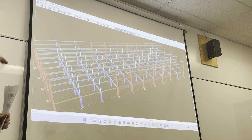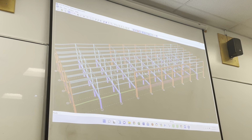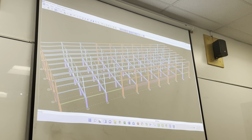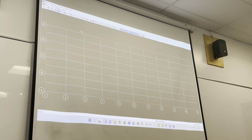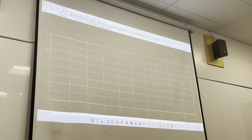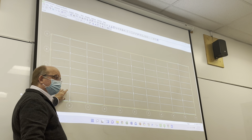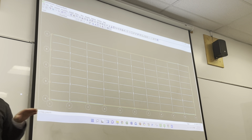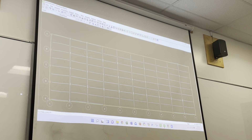Model-wise, we got to this point - we put a concrete floor and did two levels of steel. I wanted to quickly add one more level of roof. We'll go back to our plan button on the fourth floor. To copy up another level, one of the things with the floor is we've got these joists spaced 12 foot 6 inches apart. That's a little far for a roof deck, so we're going to want to change the spacing on our joists and change our design loads to a roof load instead of a floor load.